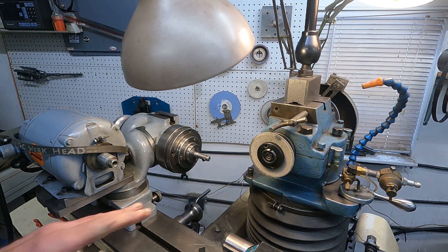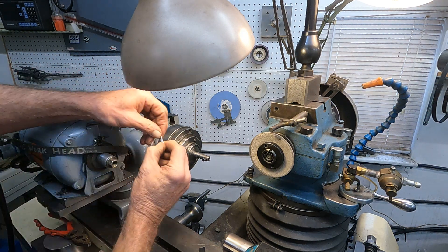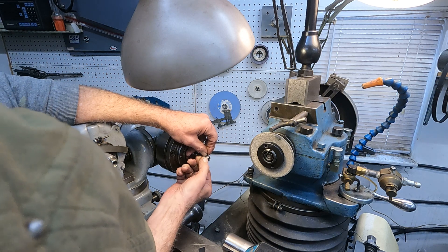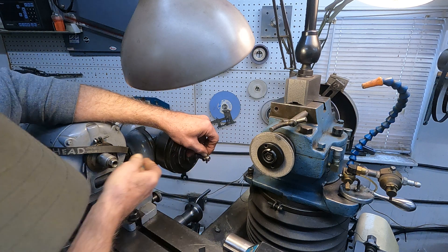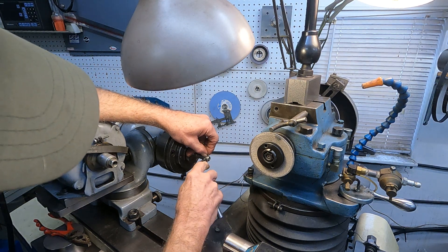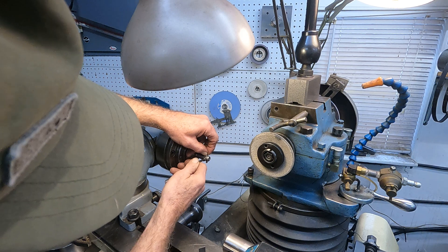I got the head kind of extended over — that's why I did that. So I take a blank and put it in here. I got this set screw; I made it a little longer so I can eyeball them. I have my Allen wrench with a handle — I made this the same size. The set screw is a little bit oversized but it's easier to handle and get it started. Make sure I got that in that notch.